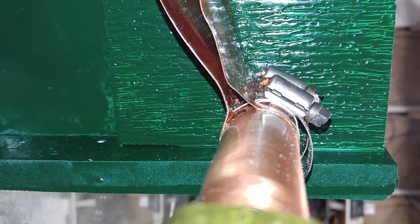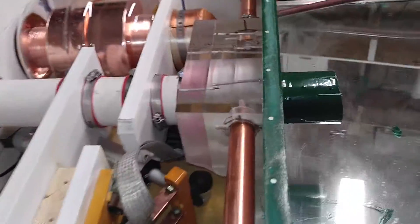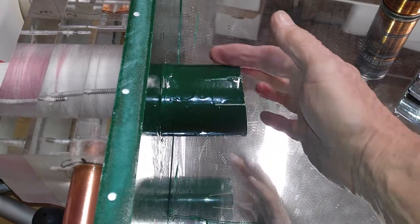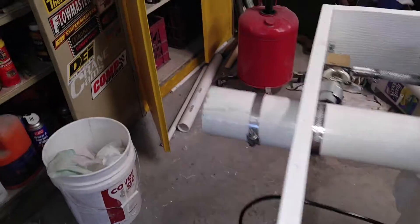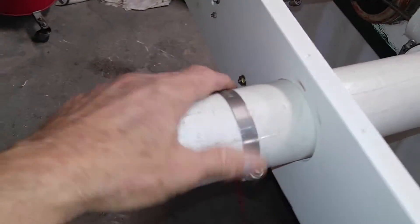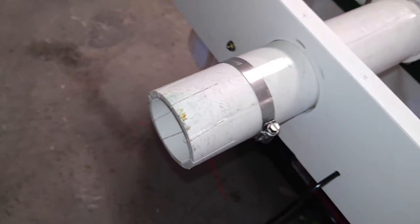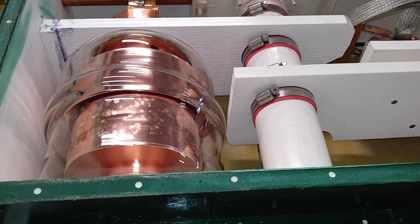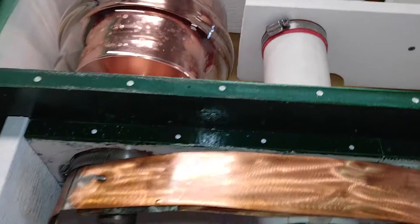We're going to put the covers on it and then mount this on the mast. The two-inch PVC mast fits in here and I've segmented this so a hose clamp will make it pinch down real nice and tight. The hose clamps just grab the two-inch pipe to hold it into place. Everything is meant to come apart — everything's adjustable if necessary. There's nothing fixed in here; I used a lot of hose clamps to provide staging for the different levels.